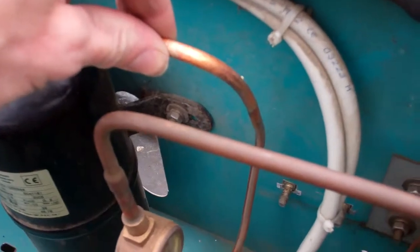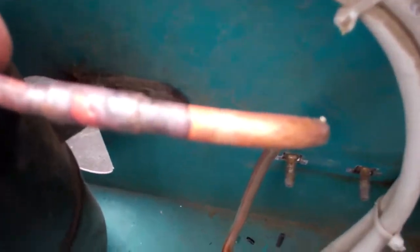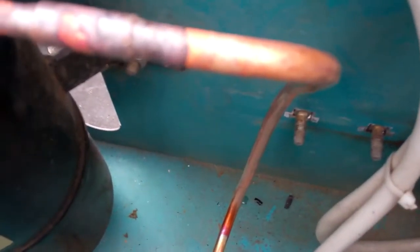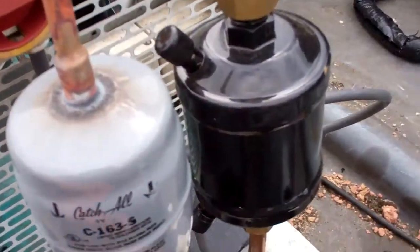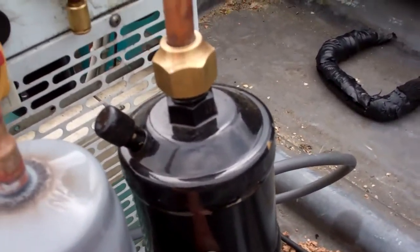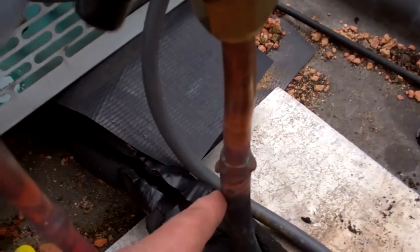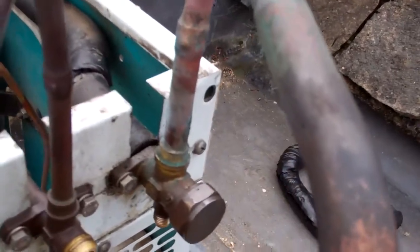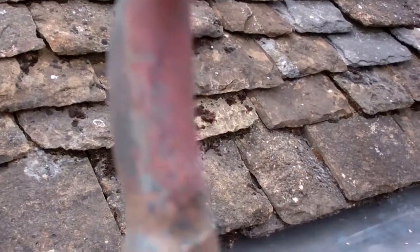The other dryer is cut out of there and I've linked it around with a bit of pipe - bit of quarter inch. It doesn't look pretty, but it's a job to get in there with a torch, so that's my excuse. I was thinking of chopping this out too, just in case the flares are as bad as the other ones. Then I noticed that was five-eighths, then half inch, back to five-eighths again, back down to half inch, and then just for good measure it's been squished. I think we'll have to do something with that.